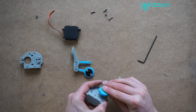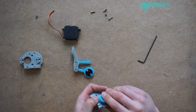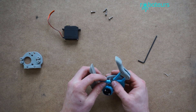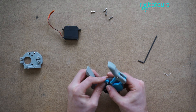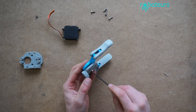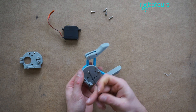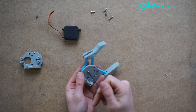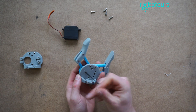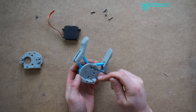These will go onto here and onto here. You can see that my fit is really, really tight and I can't push them on much further than that, and that's okay. In order to get it further down, I'm just going to tighten this screw — the threads on the screw and the striation of the 3D printing will just feed it straight through without any problem. I'm not putting much force at all on this screw, and the gripper will move just fine.